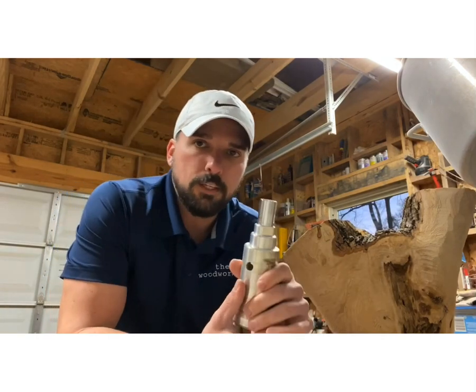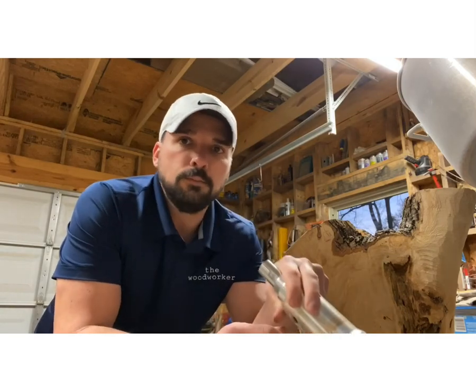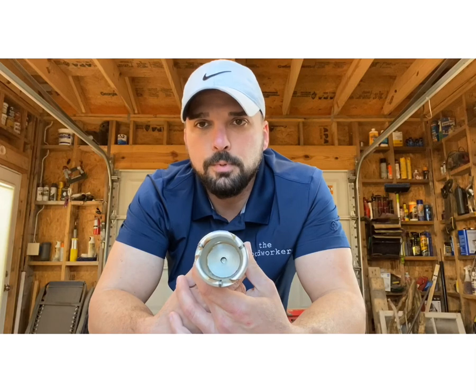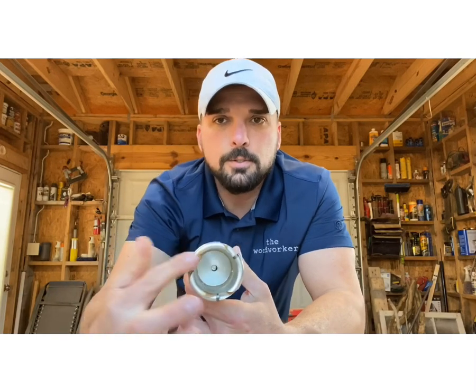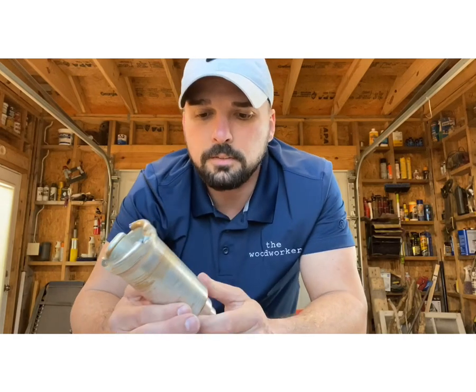I feel that bumping technique works more effectively and keeps the longevity of the tool. If you watch other videos, you'll see people just pushing it straight down — and what happens is, since there are no blades on the inside of this tool, it's only cutting on the outer diameter. So you get a chunk of wood collecting on both the inside and outside, which causes friction and overheating.